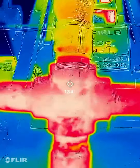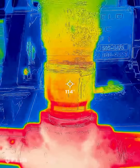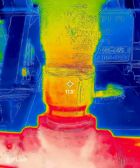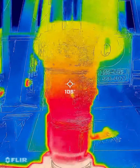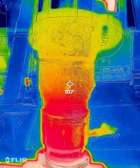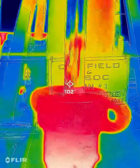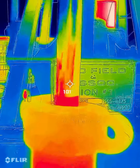You go to where the Rod Centralizer is, actually it's sealed, it drops about 22 degrees, almost a full 25 degrees on average. You go to your packing, it even drops further because you've sealed all the fluid into your flow line, all the friction. So now you're down almost 30 plus degrees. And once you get to the polish rod, it's right around high 90s to 100 degrees.